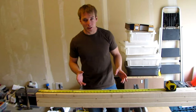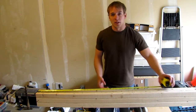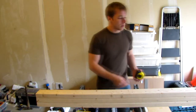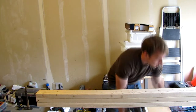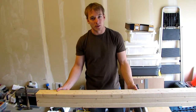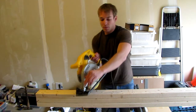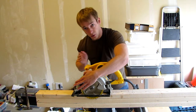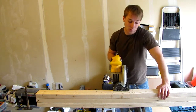I'm going to assume you already know how to cut a board, but this is my lazy way of doing it since I know I need more than one piece. What I do is I take the tape measure, measure out 31 inches which is what I need for this board, mark it out with the pencil, then mark it with a framing square. Then I stack the 3 boards on top of each other that I want. I grab my saw and make the depth just a little more than one 2x4 so that it scores the next board, and then I cut the first board and each subsequent board.